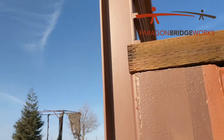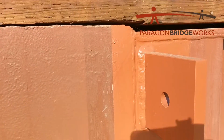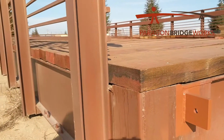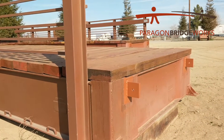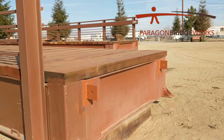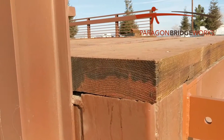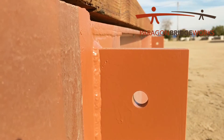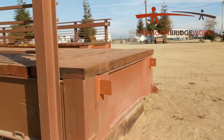Go to the other side here — you can see it's welded there, and it's also welded up on top. So if you need something specific, we need to know the hole size, the plate size, and where you want it located. Or we can just put them on there — our typical specs call for what our engineers specify. The one critical part is going to be the diameter of that hole. We're going to need to know what size shackle. I believe that's a three-quarter inch hole for the pin on a shackle, but if you want something special or different, just let us know.